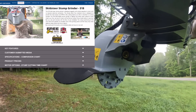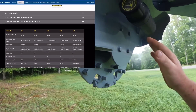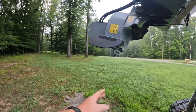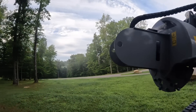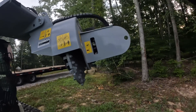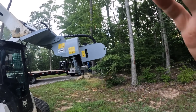This is kind of more of a basic model. It has replaceable teeth on it. It actually works by just moving the skid steer forward and backwards. We'll pull this pin out here, and this thing actually pivots. It will just go along and eat the stump out there. The nice thing about this style of stump grinder — you get full power to this hydraulic motor. Some of the other models they sell have the swing model, which takes a little bit of power away from the hydraulic system. We've got full power to that motor at all times.